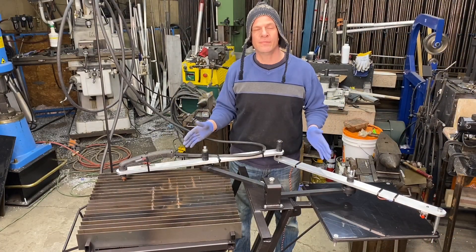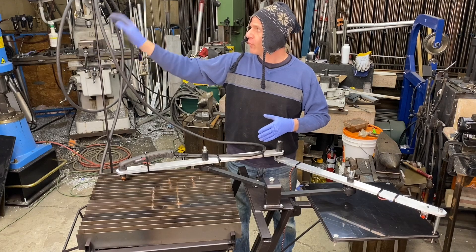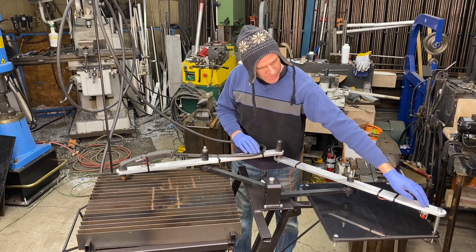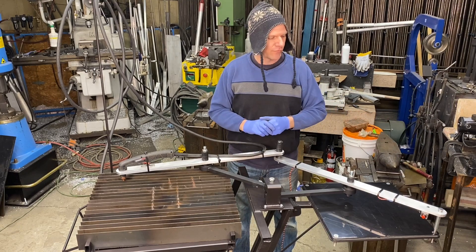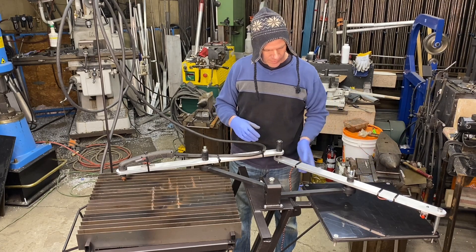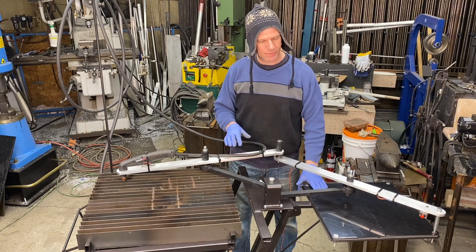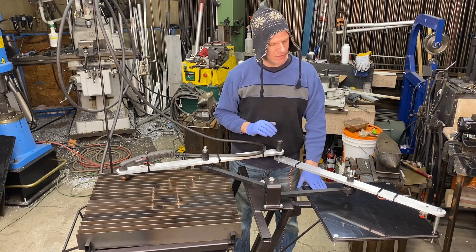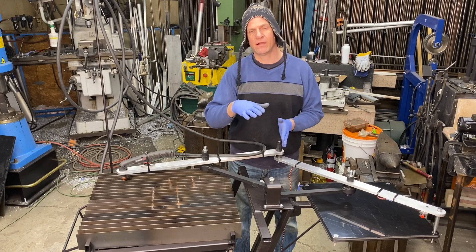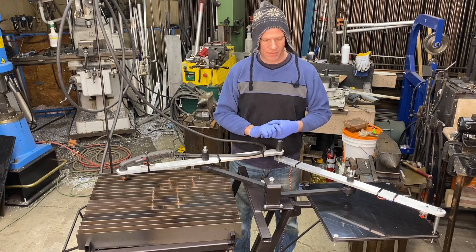It's all painted up and ready to work. There are a couple of modifications I made. I put this bar here to hold the cord up so the cord itself won't snag as it's moving for the plasma cutter. The button itself I put underneath for now — over time I'll see if it works or if I need to move it to a different location. I put those on with a couple of zip ties underneath for now. I also painted the arms and put a piece of puck board underneath on top of the copy plate itself. This copy plate will swing down — there's a little bar here that holds it in place so it can be tucked away in a corner when you're not using it.